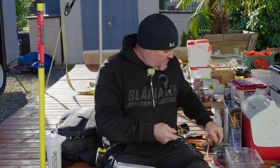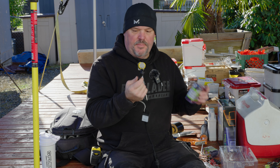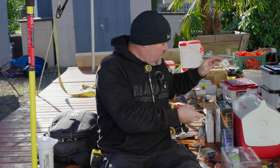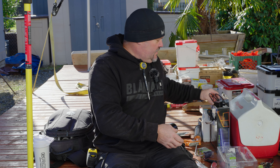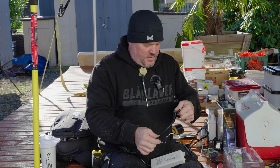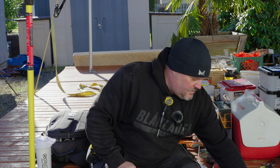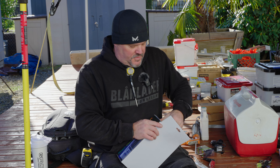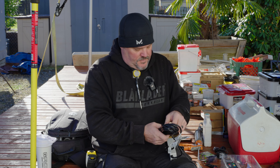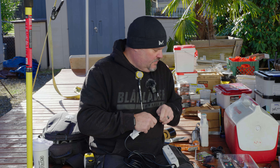Wait - that is not the case. I think that's what the adapter is for. The Yardlight adapter is actually for the LED there. I don't think I have the right part because this won't hook up to this - I must be missing something to make this LED controller work. So we'll set that to the side. This other transformer is also 60 watts but on a 12-volt system, so they must have something that'll buck the voltage down off that other transformer. I'll have to give you guys an update on that.